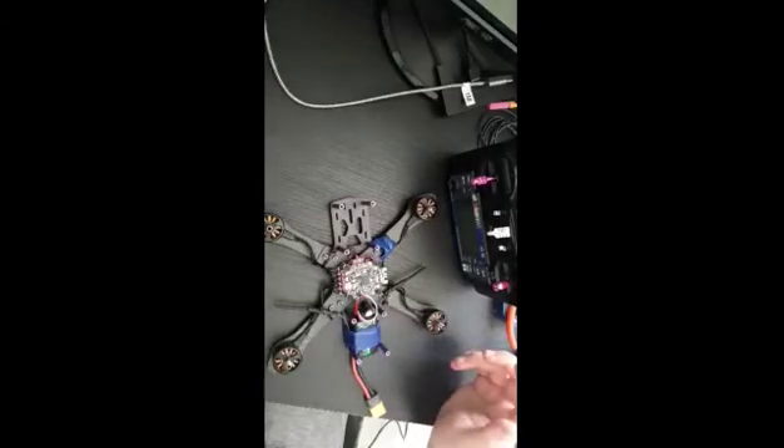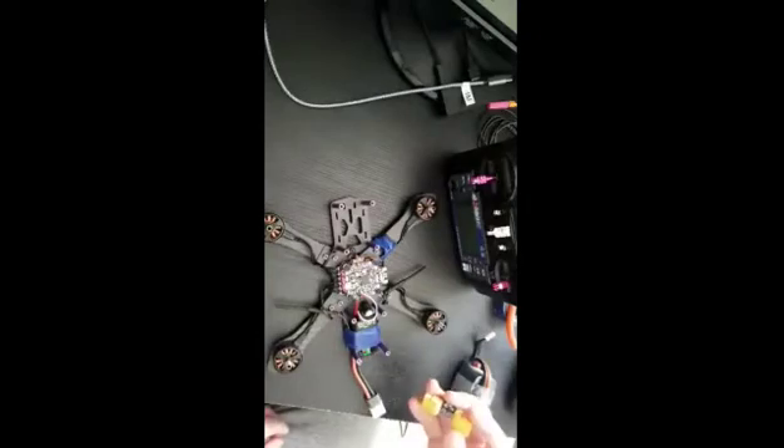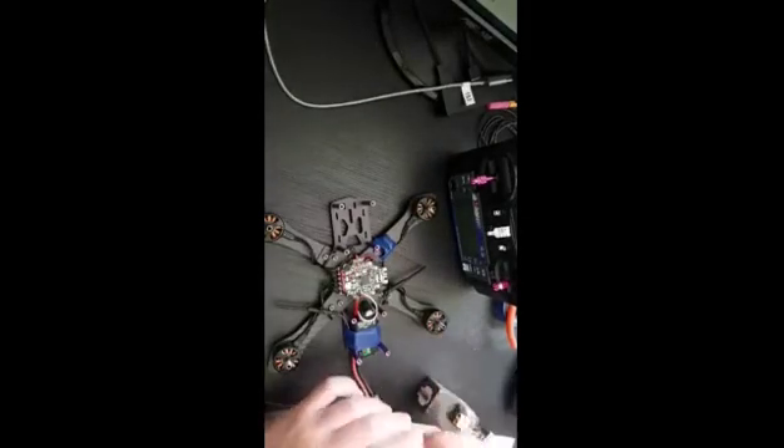Again, this is my first drone — if you have recommendations, please write in the comments below. I used four motors which are the T-Motor 2306, running at 2500kv. I think for beginners they are fair enough. I did some research and got very good feedback. I totally recommend the smoke stopper, which is about four dollars online — it prevents damage if you have a short circuit.